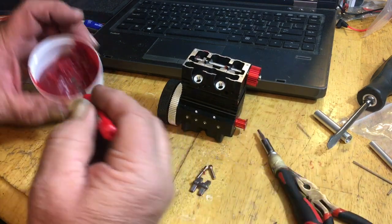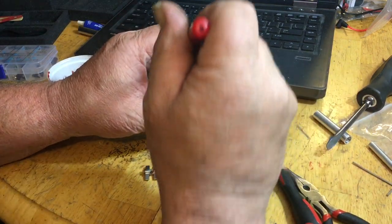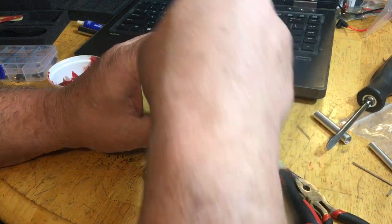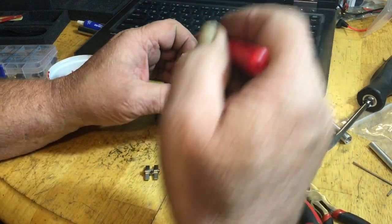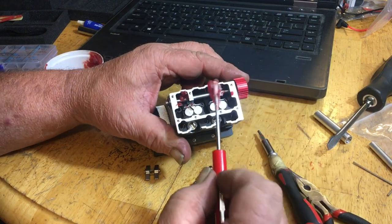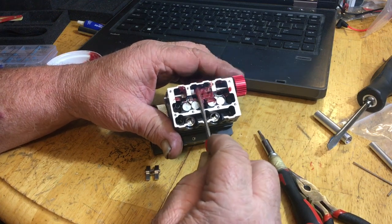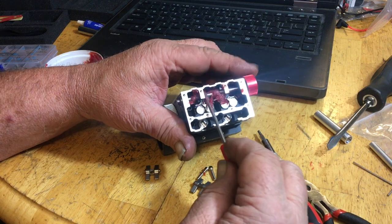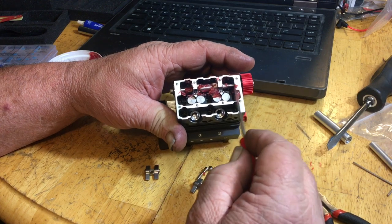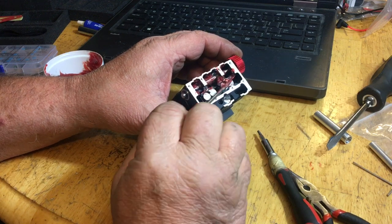So we're going to pack this full of grease and make sure our camshaft is well lubed. All the lobes, just put them in there where you see them. Just fill it right up because you're going to have to pack it again later. So I usually turn the camshaft and just let the grease flow over it and move to the next one and slide it over, move to the next one. You know what I mean? What you need is a good coating of grease on the lobes so they get to break themselves in. And you want some on the top of these here, too.